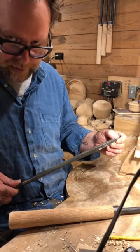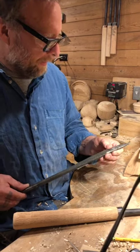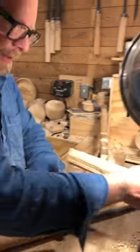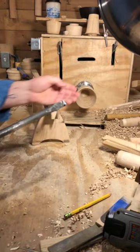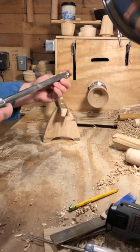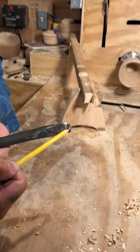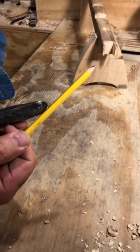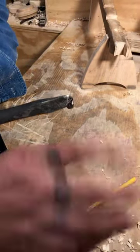I don't necessarily like the name, but it comes from Martel's hook. So with that said, I developed an idea on this end grain turning with this Japanese lathe. You want to skew, the blade needs to skew as it comes out. And so I'm going to be using this part of the hook here as I pull out, and it gets that same skew because the blade is on an angle, or the edge is on an angle. So very similar to that hook, it's just set up differently.